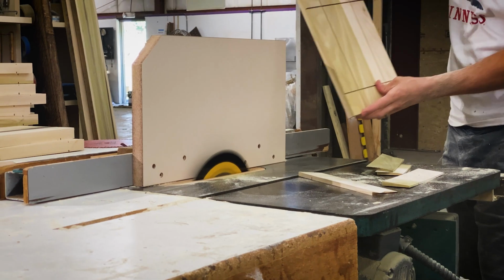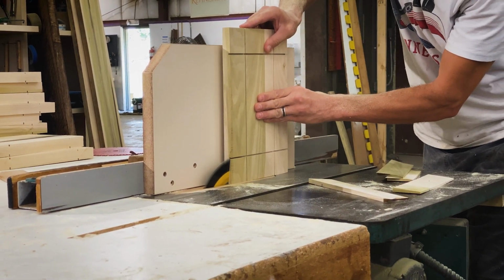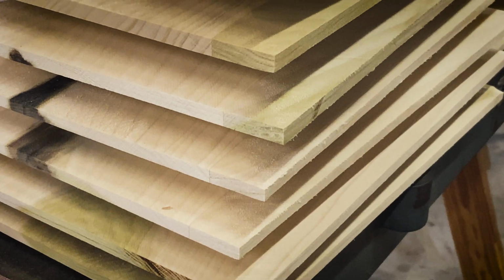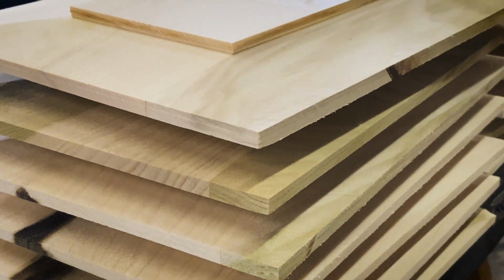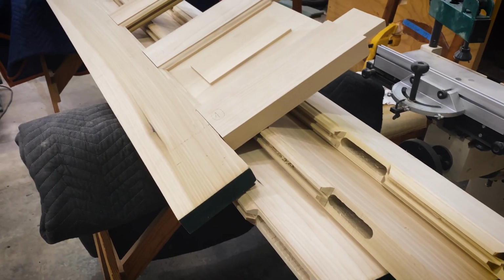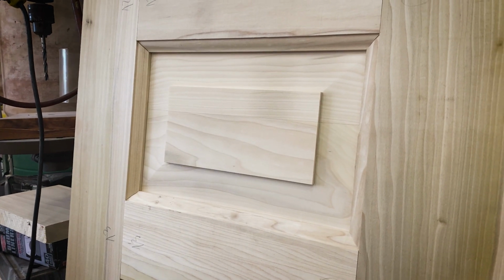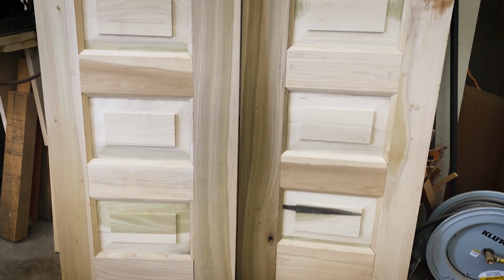The center panel pieces are thicker in the middle, which helps prevent the wood from splitting. If the entire panel were this thick, it would be too heavy, and the door frame would need to be thicker to accommodate the joinery. The edges are tapered gradually to fit into the door frame's routed slot. The raised middle section of the panel is designed to provide strength and reduce the likelihood of splitting compared to the uniformly thin panel.